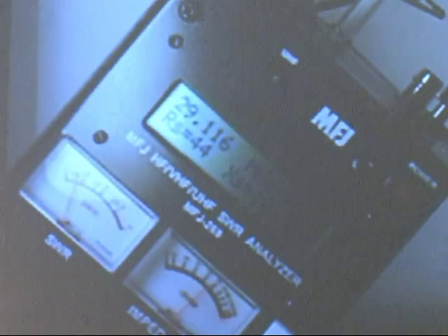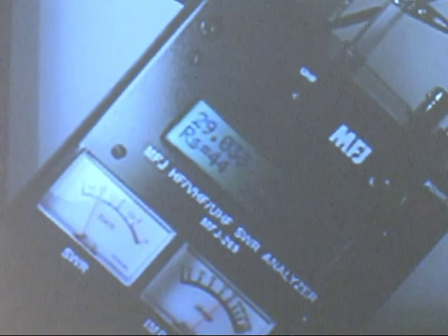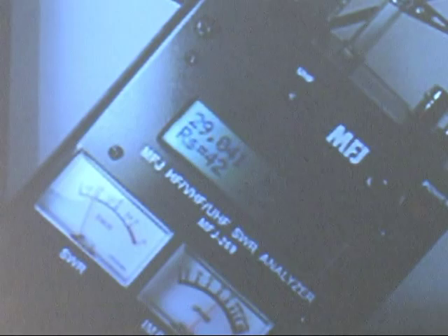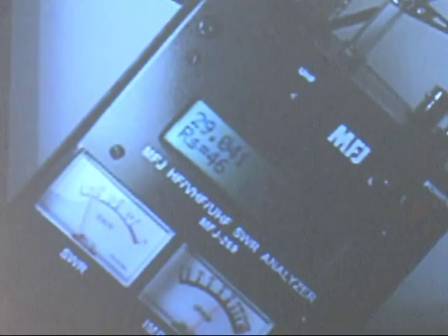The more wires, the better — it'll make the SWR go down. The reason it looks so good with such a low SWR is because there are losses in the antenna. This one may not be bad — it's 28 MHz, so it's not that short. If it were much lower in frequency, the radiation resistance would be real low, and with a good ground the SWR would be real high, and you'd need some kind of matching network. If you have a mobile antenna that's short trying to operate on 40 meters and you get a 1:1 SWR, your antenna's not much good unless you matched it.